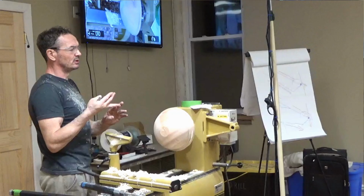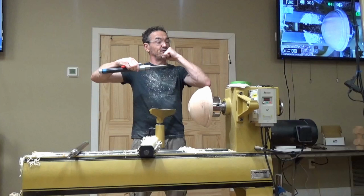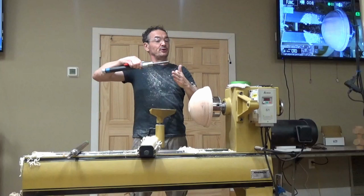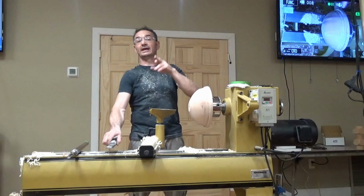So this piece of maple from before, my jam chuck, that would not negative rake scrape. But the ash wood, honey locust wood, oak does, elm's okay, reasonable, but soft punky woods don't work. And the reason they don't work is that the burr, as soon as it touches the surface, takes off more material than you want, and it blocks the burr. It wraps onto the burr and grips it and stays there. So to get rid of it, you start pushing harder, and you snap it off, and then it grabs a big lump again. So it's not effective on punky wood.